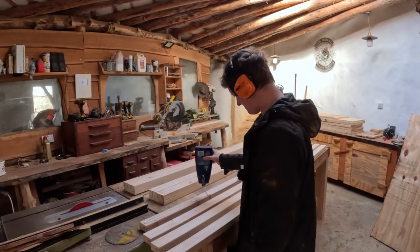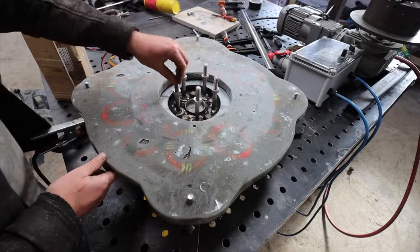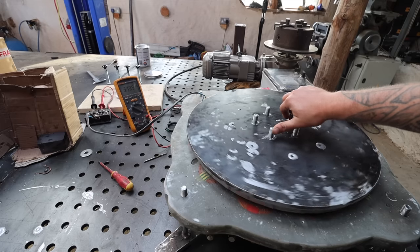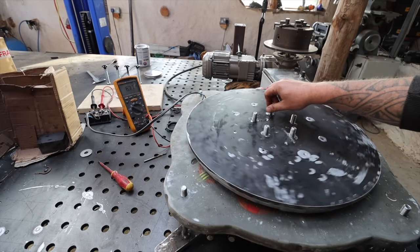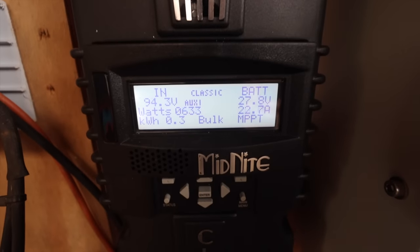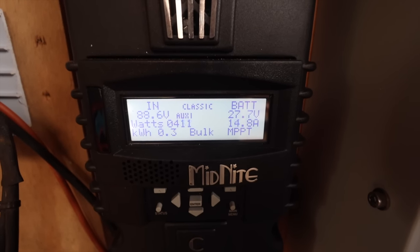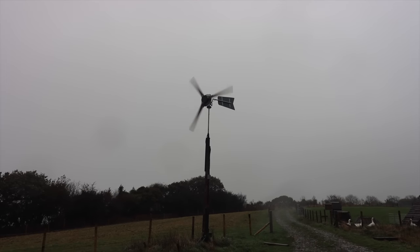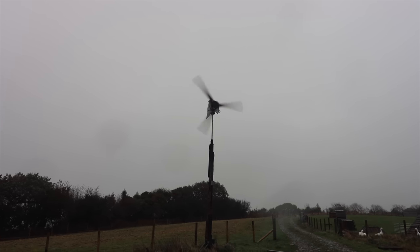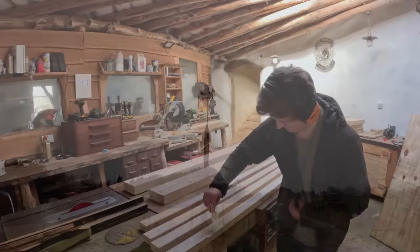Hey everyone, so I've been working on that barn foundation and I felt like I needed a bit of a break to do some woodwork in the workshop. In the last wind turbine video we made a really big nice slow-turning alternator - an axial flux alternator - but I put the old blades on and it worked really well and I got really good power output. The trouble is it had high peaks, wouldn't work great in lower wind speeds, and would spin very fast and was quite noisy. So I wanted to make some bigger blades to slow the whole thing down to get more consistent lower wind speed startup - a slower turbine that's less noisy and more reliable. That's why I'm making some bigger blades.